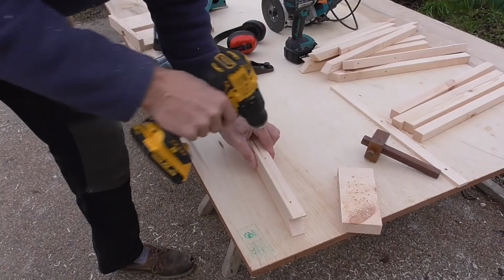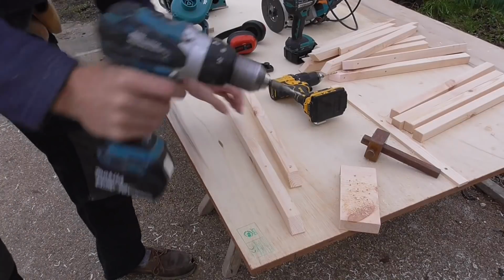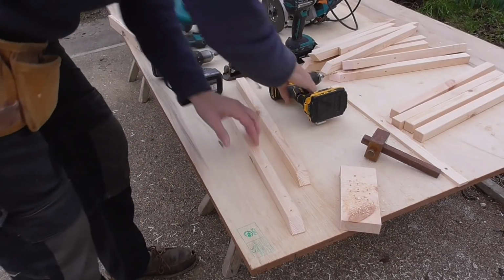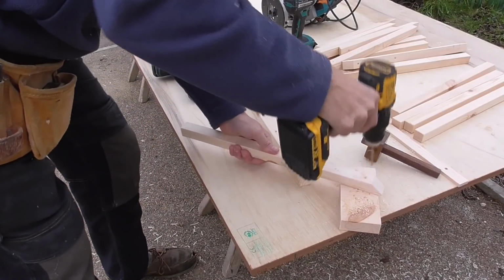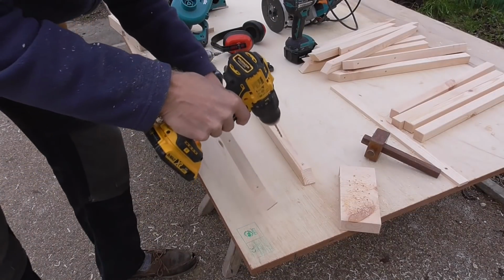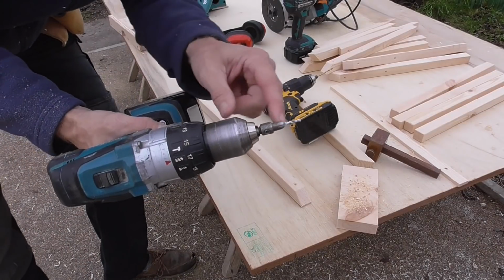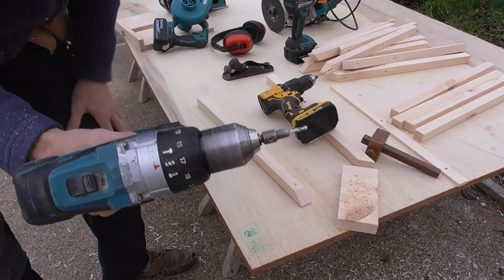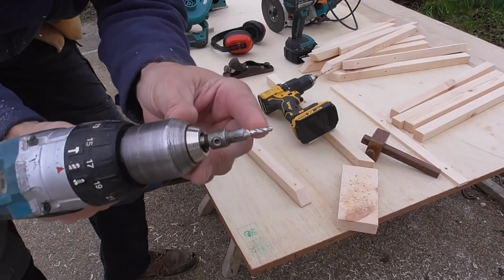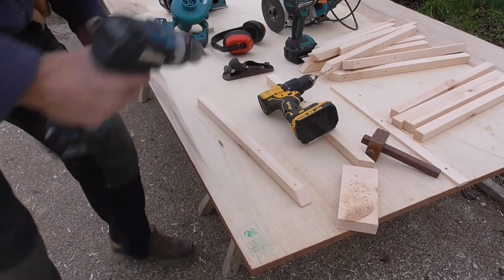Put it through with a 4mm drill bit first, just lightly, just to mark it. Then with the countersink bit. And then finally all the way through with the 4mm. I don't go all the way through with the 4mm on the first, when I'm marking it, because what tends to happen is that this can get wound in quite aggressively and you don't get quite as much control, you end up making a bigger countersink. If you only put the hole in shallow just to mark it, you're still pushing down on the drill point, which gives some resistance, which means you can control your countersink better.